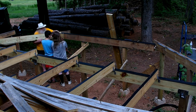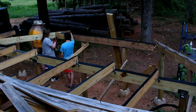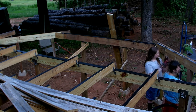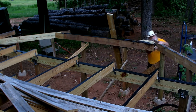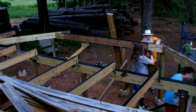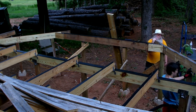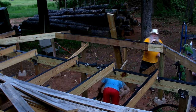We're doubling up this board — I'm telling him what to do and we needed a pair of clamps to pull it together because it was bowed just a little bit. Then we're tying in the end piece with a 45-degree cut, tying it in so everything gets locked together. No part of the frame is separate from the rest of the frame — before this, the back supporting frame wasn't tied to the front part and had no bracing connecting them, only the joists.